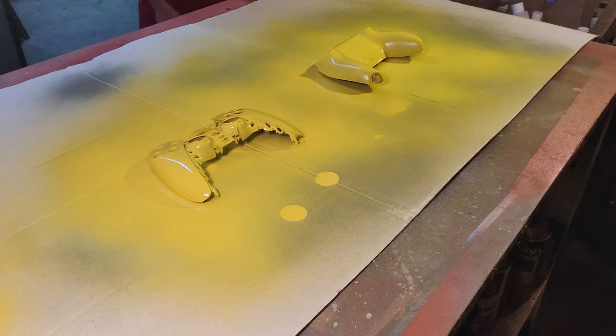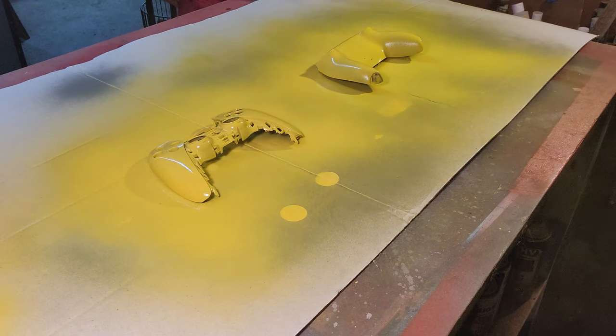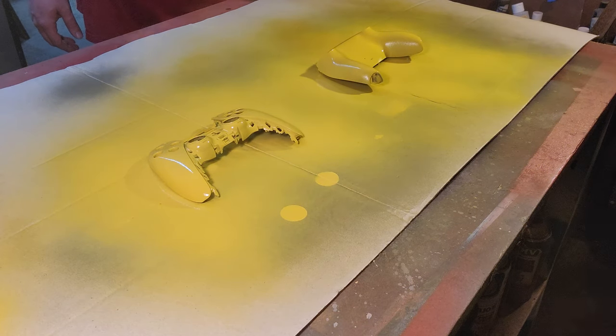It's glossy. And it's evenly coated. It's not pouring off of there. You don't have big, heavy drips. Again, three coats, with 15 minutes of dry time between each coat. This allows us to have a nice, even coat of paint on our project.